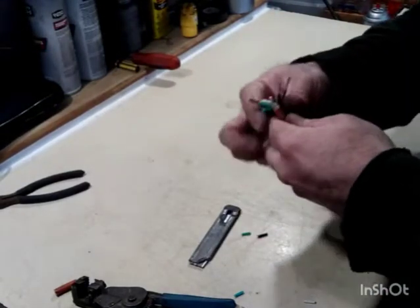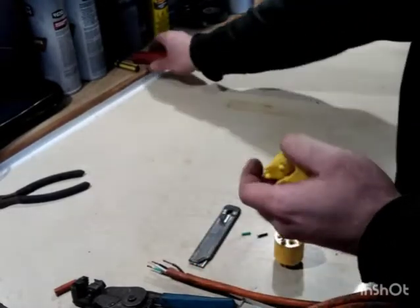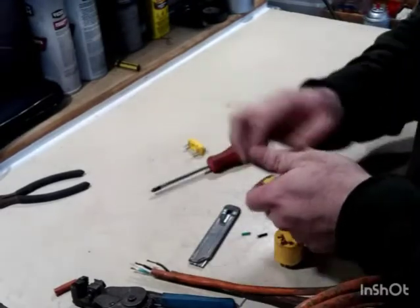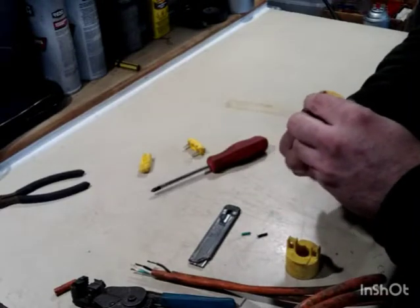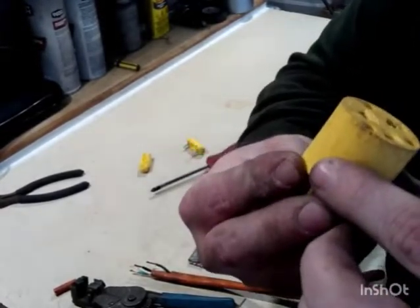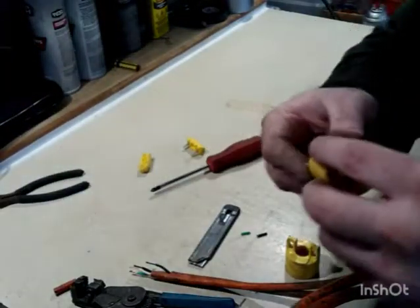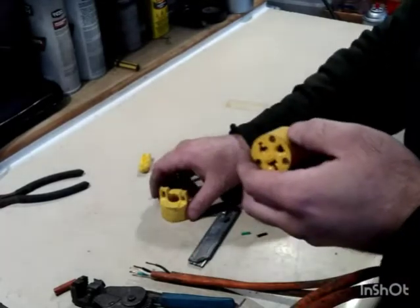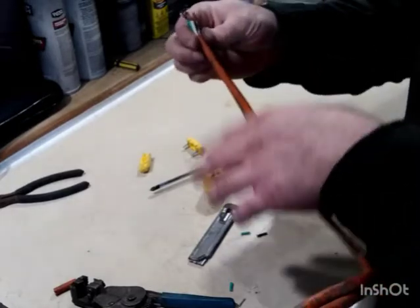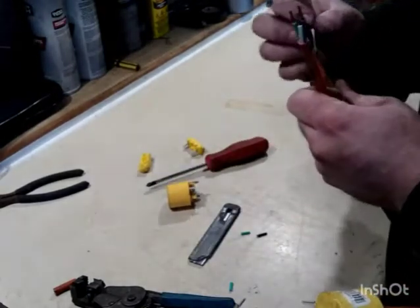Before you start twisting all your wires together, you'll want to take and disassemble your plug. This one is a slip-over, so I'm going to have to take this off. Now in my building I actually wired most of it myself because I'm a contractor, and I just use these high-output plugs. It's basically like a 110 plug but it's actually rated for 250 volts. So I'm actually running 220 on it. If you're using these kind, you're going to have to slip this down and over your wire before you start doing anything. I've actually wired these a few times and forgot that step — it took the whole thing back off and it's an aggravation.